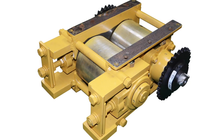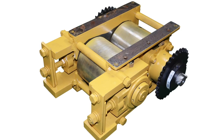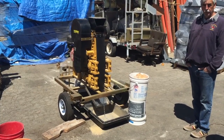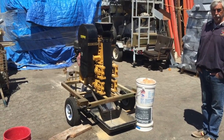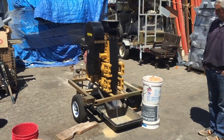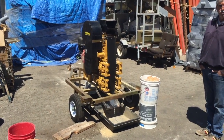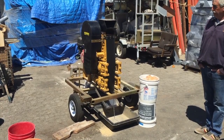The main advantage of the double roller is it allows you to run the material through the machine one time and achieve 50 to 150 mesh in a single pass. That's been an issue with our crusher in the past. Most customers ran the machine twice, even three times, to get the desired grind. So it really makes a big difference to get a much finer grain in a single pass.